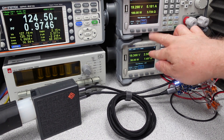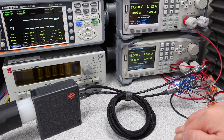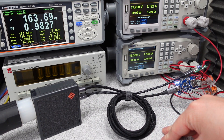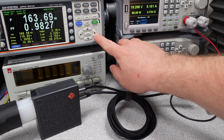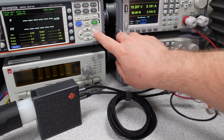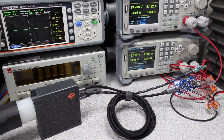This adapter has lots of modes of operation. It can do fixed output voltages per the USB Power Delivery 3.1 specification. Each USB-C port can deliver 5, 9, 12, 15, and 20 volts. This adapter also has a 20-volt PPS mode — a variable output voltage mode for more efficient charging. This mode has up to 60 watts of total output power, so no 5-amp charging here, and Samsung won't max out here. The cost for this adapter is about $90, which is actually on the lower price side for this range. The USB side overloaded at 104 watts and the main output overloaded at 151 watts — a positive sign that the adapter functions correctly even if not third-party verified.